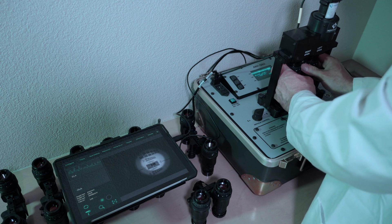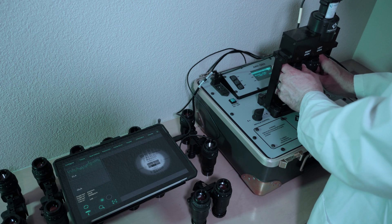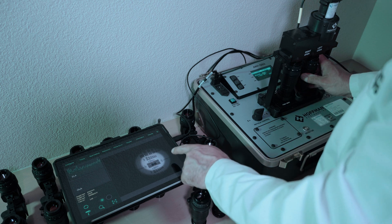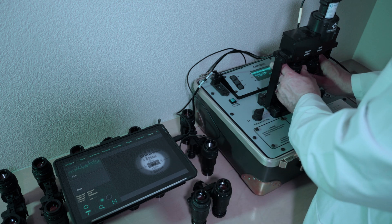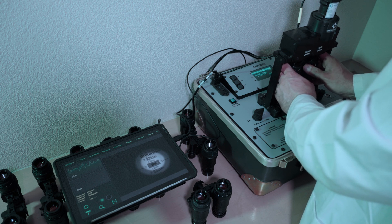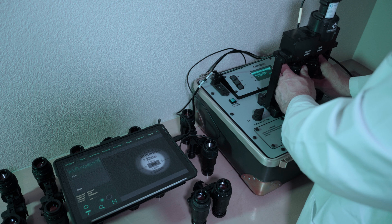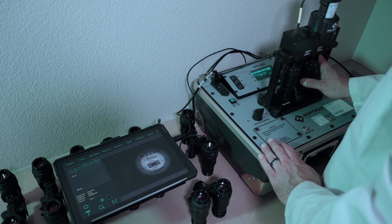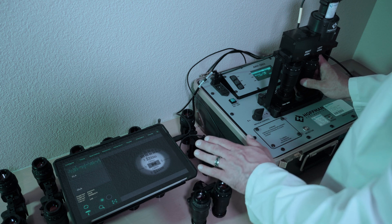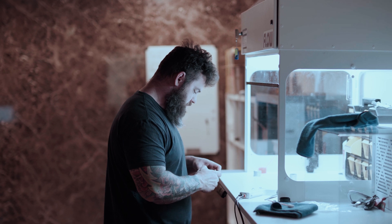Because there is an offset built into that eyepiece, I'm adjusting the image shift, trying to find a place where these two images overlap that is close to what we would consider bore-sighted — meaning the center of these two circles. Now those two crosshairs are perfectly overlapping each other. The standard for collimation is basically the lower crosshair inside of the small box to meet mil-spec. It doesn't have to be this perfect, but a responsible night vision builder or technician will always find a place as close to this as possible.